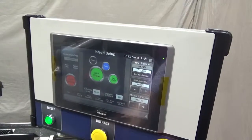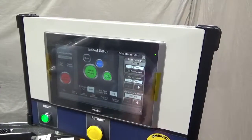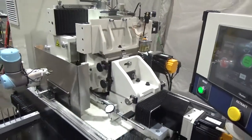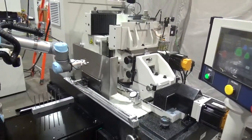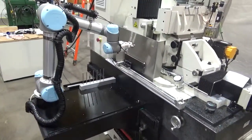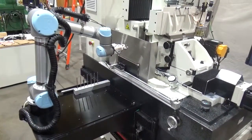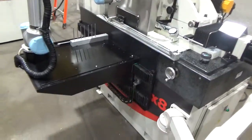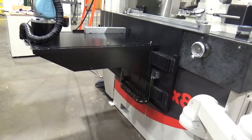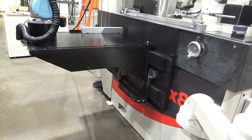This model, TG-12x8, has close tolerance capabilities in a diameter range of up to 3 inches. With infeed or through-feed, the collaborative robot makes the grinding system versatile and efficient. The collaborative robot is mounted on the side of the machine base with bearing guide rails. There are adjustable pin locations for robot run mode and machine setup mode.